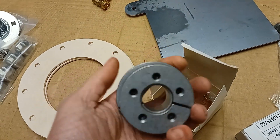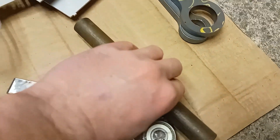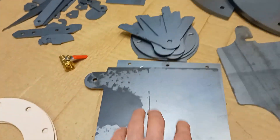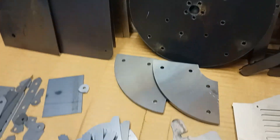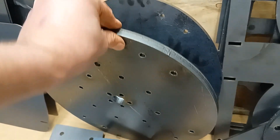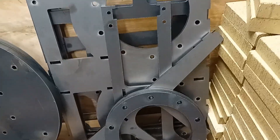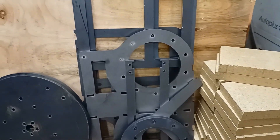These are clamping elements I'm using to attach the flywheel and crank to the crankshaft. These are used in industry quite often instead of having to machine a keyway into a shaft. This is a door for the furnace — it's a gravity-fed furnace. These pieces are part of the piston assembly. At the back we have the flywheels — this is a very convenient way of getting a nice heavy flywheel for not much money, laser cut with all the holes ready to go. This is a counterweight for one side of the flywheel, and here are all the six-millimeter plate bits. I'm quite excited — it's all come out quite nicely.